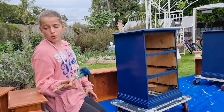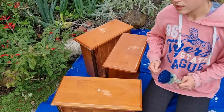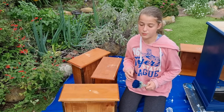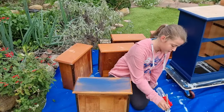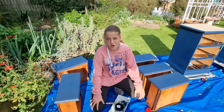Okay, now I'm finished that, I'm going to go up to my drawers. I filled in my handles and I used a 120 with my orbital sander to sand it and make it smooth with the rest of the piece. Okay guys, so I've already done two drawers — now when I click my fingers I'm going to have all these drawers painted already. And done! I'll be back soon to do the second coat — I'll let it dry for an hour.